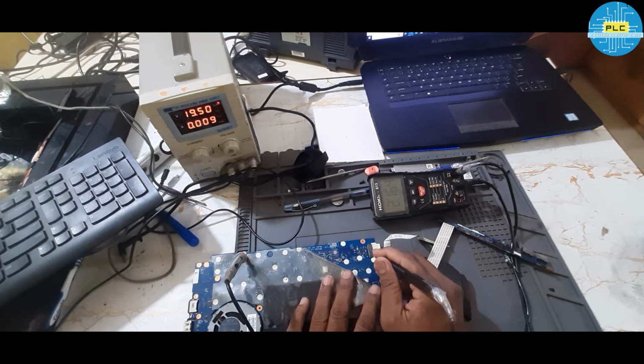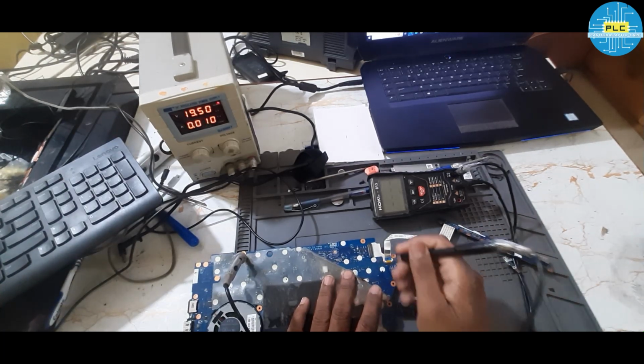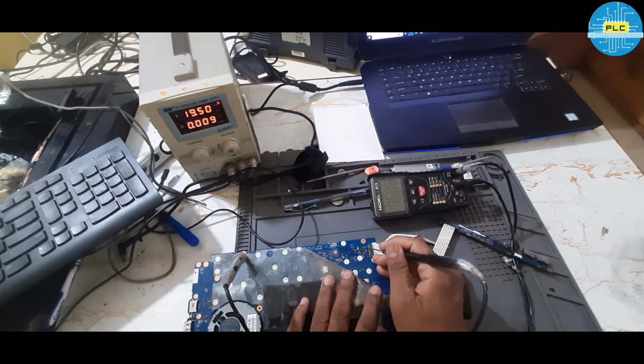I'm not talking about this case, but these kinds of cases, some technicians I'm telling, not all. See, still here it's 2.1. In some videos I already explained CMOS technologies and TTL technology, you can check the video. There will be a voltage limit. Here actually the power voltage should be 2.7 usually, but here I am getting 2.1. Maybe that is the reason it's unable to turn on.